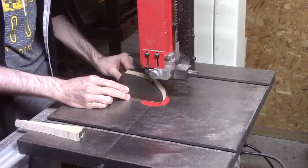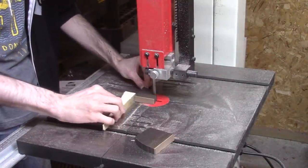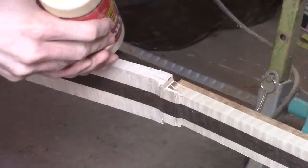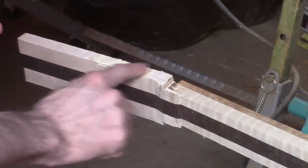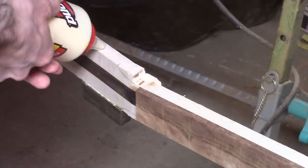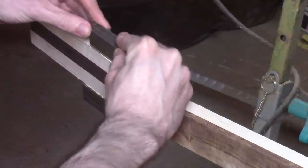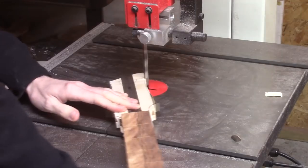And here, cutting out a little piece from one of the cutoffs. There is a reason for this. Because the headstock would not quite be wide enough. So by putting on an excess piece from one of the wings, I'm making the headstock match the rest of the body, in that when you see the front of the body, you see bog oak, pale moon ebony, walnut, flame maple, wenge, flame maple, you know, and it continues on the rest of the way across. Now the headstock matches that.